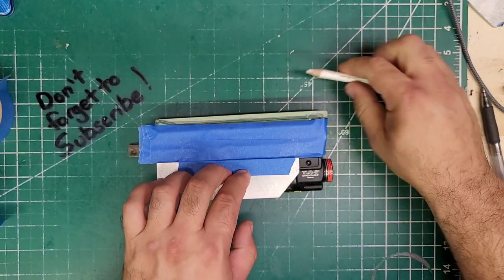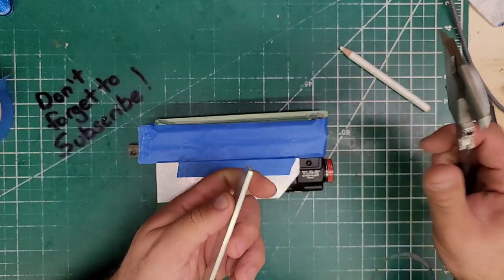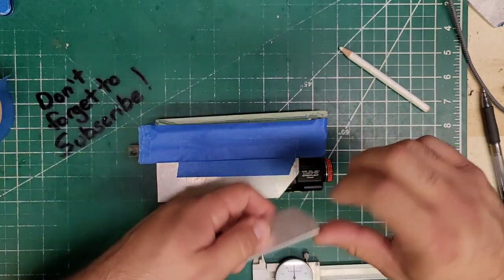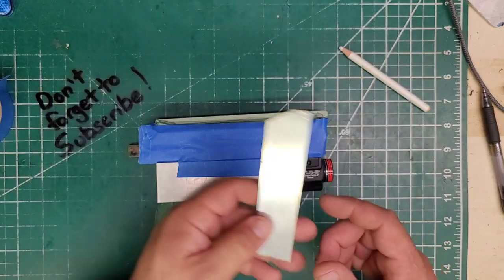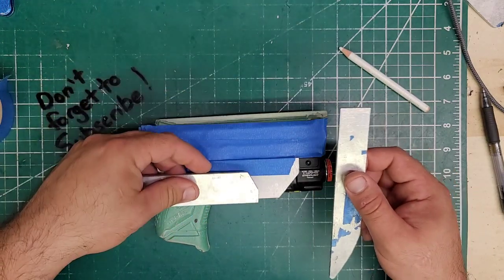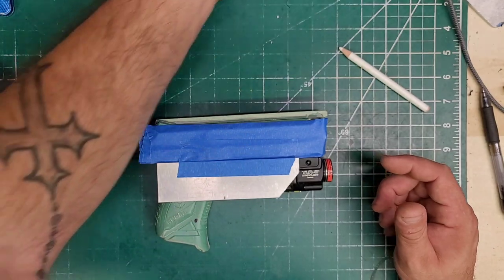I also get a lot of questions on what these are, so let's get into that. This is aluminum flat stock from Home Depot, and I've said it before in another video. It is 0.131, give or take a couple thousandths, when you buy it. These have been bent and mangled, so at least 0.130. You could get them at Home Depot in different widths, I believe. This is one width you can get, and then the other one is this size. I made the one in the middle by just cutting it on the bandsaw, so this is cut and made to fit. But they're relatively cheap. They're like 12 bucks for like a 4-foot section or something like that, and then you could get a lot out of it. So that's what I use.